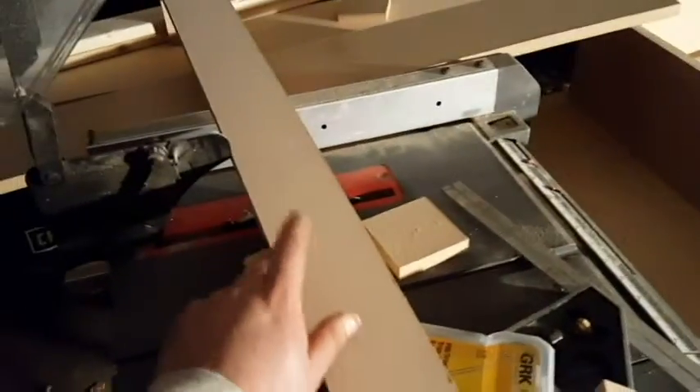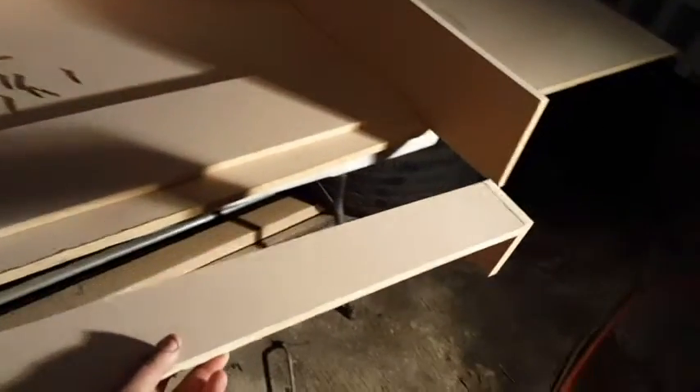That's what I have right now — cutting them up and framing them. This piece is going to be cut at 45 degrees and will sit in on all four corners like that. This is going to be like a little collar — a neck piece between the entertainment center and the frame — where I'm going to hide all the cables running through. It'll be painted the same color as the wall. Ultimately this will sit right below the frame. Let me finish this up and I'll show you guys how it looks in the living room.